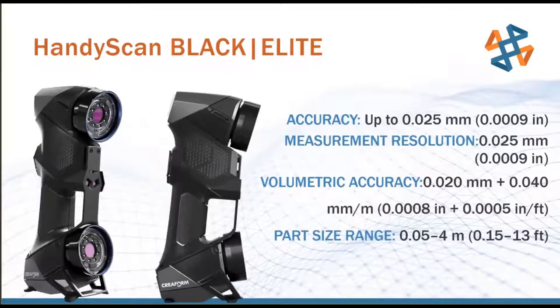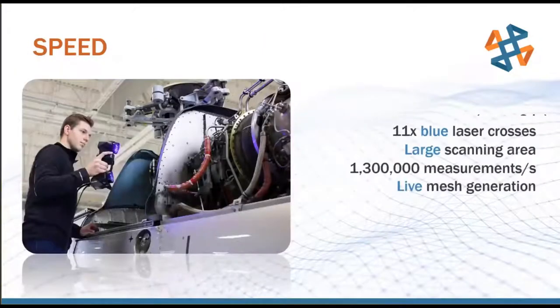Next up, we have the HandyScan Black Elite. This is our laser-based metrology grade scanning solution. You can see there we have significantly better accuracy and measurement resolution than the Go Scan, at 9/10,000ths each versus the 2/1000ths and the 4/1000ths for the Go Scan. We're using 11 blue laser crosses for a large scanning area and 1.3 million measurements per second.